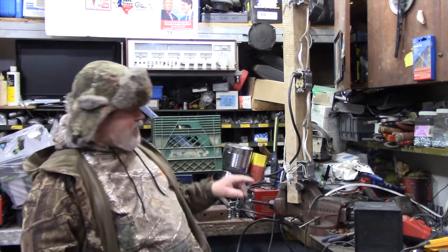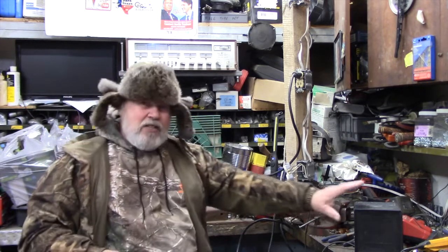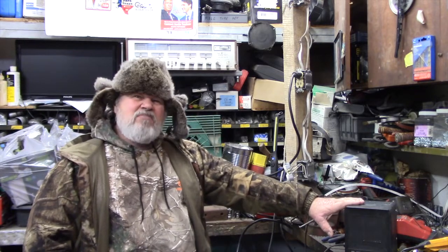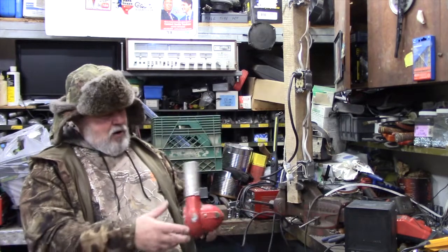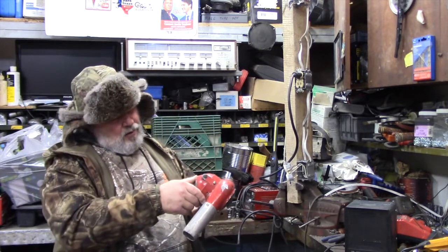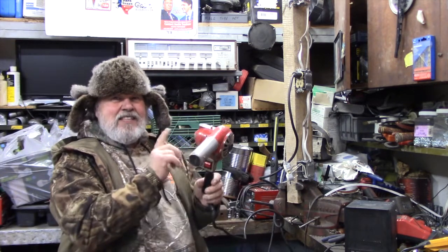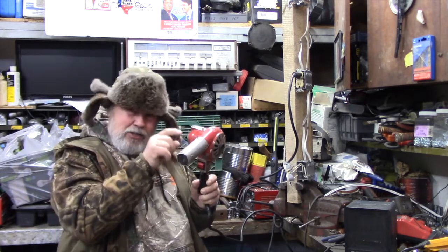Okay, get back to this here. I'm just going to show you why resistive heat is a problem. These little heaters, see this here, it draws about 750 watts. This here draws 1500, I think. Is there a nameplate on here? It doesn't say in watts, but it draws 18 amps. So this is a good load. 18 amps. The breaker is good for 15.